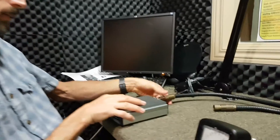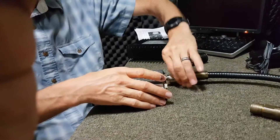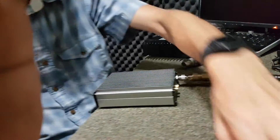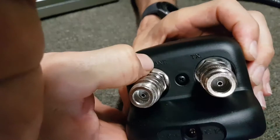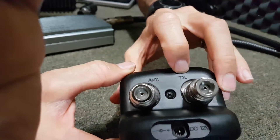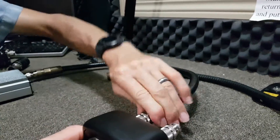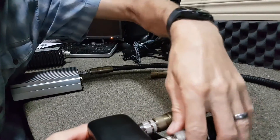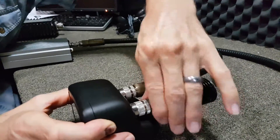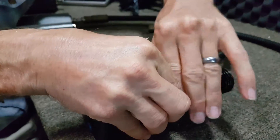So we're going to go ahead and hook this transmitter up. These transmitters do have a small adapter on it, so just beware of that when you're screwing and unscrewing. We're going to hook up this cabling and go ahead and hook up our watt meter. You'll see these are labeled - one says ANT for antenna, one says TX for transmitter. We're going to hook TX up to the transmitter side. Make sure the connections are on nice and snug - you don't have to over-tighten, but just make sure it's snug.